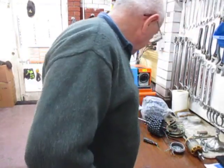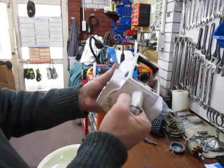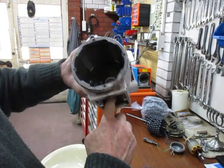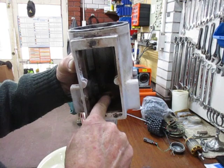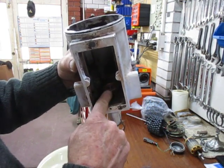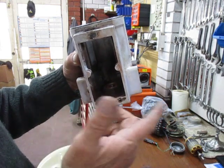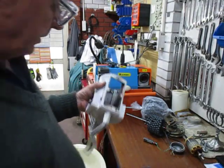The other item I worked on yesterday was some sort of electric unit from a mine site. The bearing housing part here had been flogged out. So I've made up a brass insert and bored out the base there. There's another video that shows that work, and I've fitted that bearing in. So this will also be going out this morning.